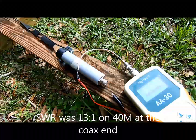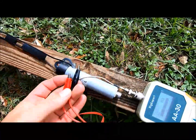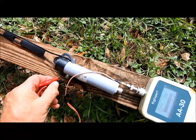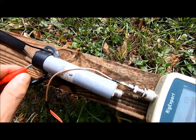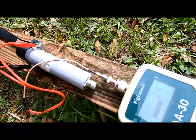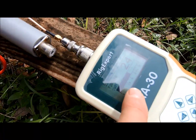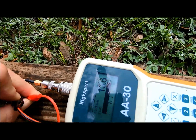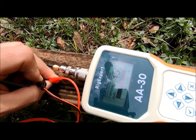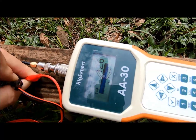We already know what's going on. Let's go ahead and just bypass our balun without disconnecting everything, and the way you do that is by having an RF jumper — a 50-ohm cable broken out to a couple of alligator clips. You can see that we're not doing so bad right now, but when we hook up straight to our balun, you can see that something's rotten in Denmark. So let's go ahead and disconnect this balun, take it inside, and see if we can take it apart and find out what happened.